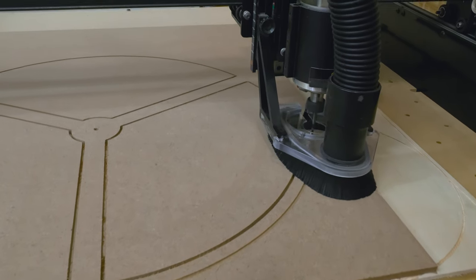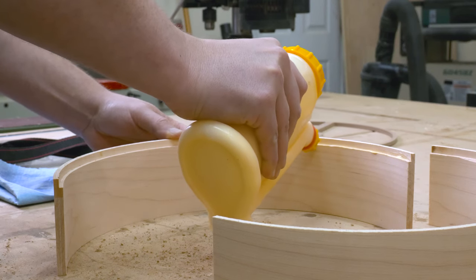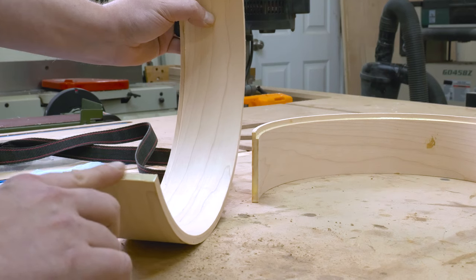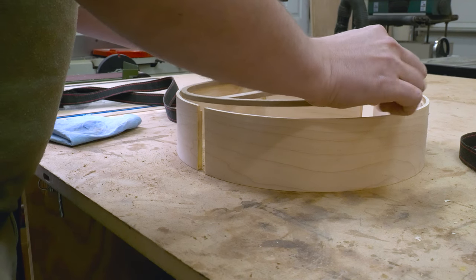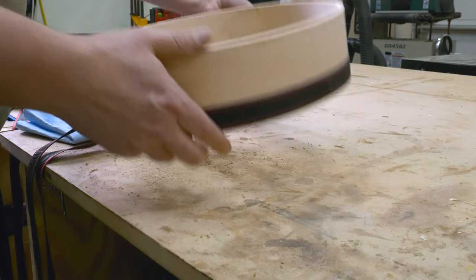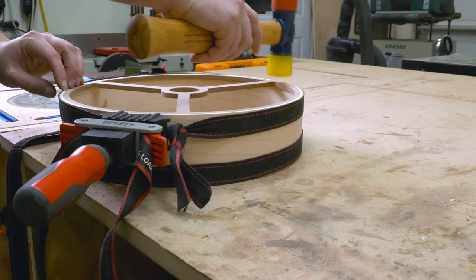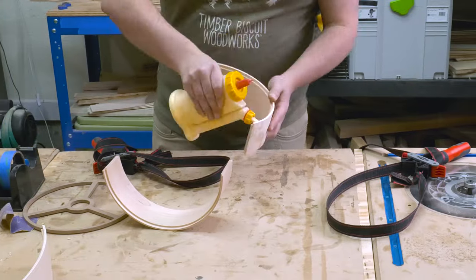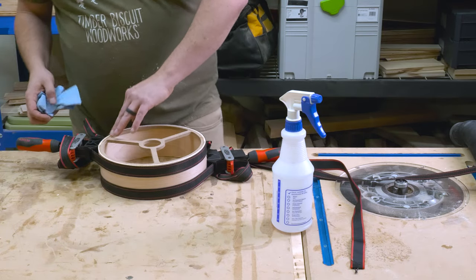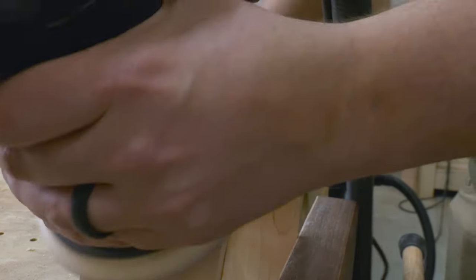Back at the CNC I made the mounts that would hold the light fixtures. Then it was finally time for the lights to come together — I decided to glue all three pieces in at one time, applying glue to the rabbet in both end-grain pieces and using strap clamps to squeeze everything together. The insert allows the rings to be perfectly circular and gives a little support for clamping. I could then repeat the steps four more times. In between glue-ups I sanded the seams with a random orbit sander, though I did have to hand sand the inside.